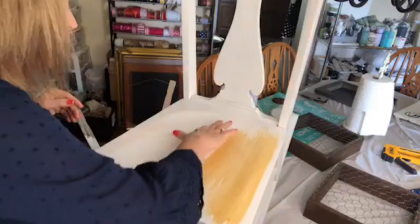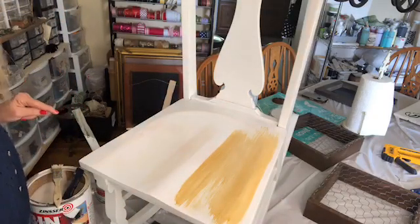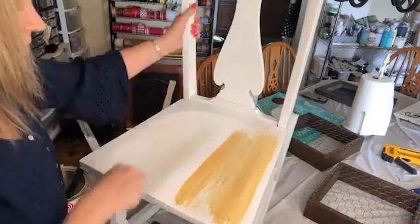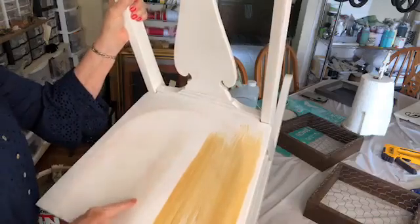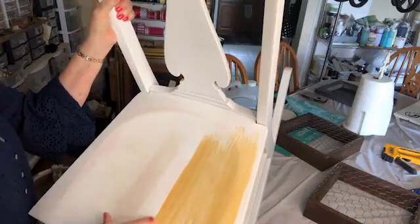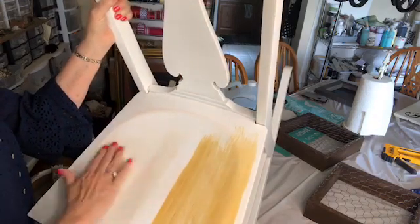I don't know if you guys could hear me while I was talking, but the oil-based primer or the shellac seem to be doing the best. The two on the outside. I feel like this center, the BIN, it's blocking it, but I feel like I can still see through it a little bit. Did this dry down enough? The oil should still be wet.